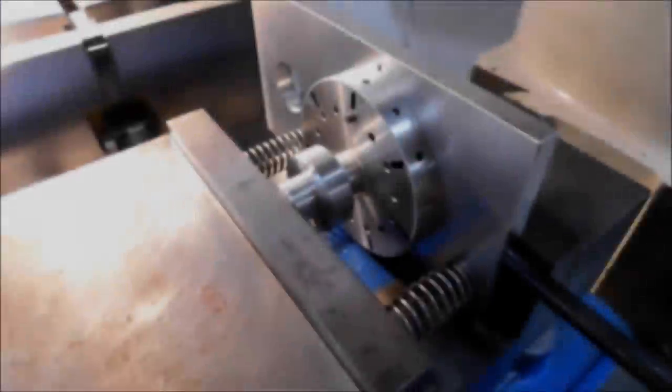I know that this 250 hole is 0-0, and I know that on the x-axis from the stop, it's not going to migrate, so I do not need to set my x distance right now. It's already set. I'm going to stand this plate up. The only thing I will need to do at that point is edge find the actual hub, and off we go. Let's do that.